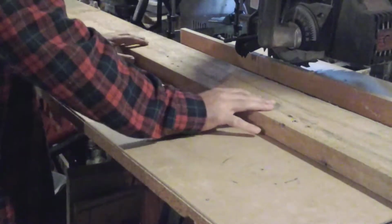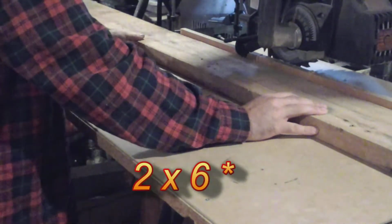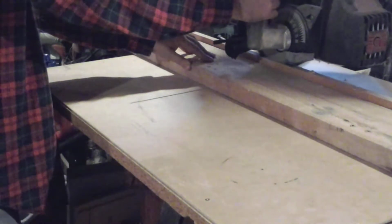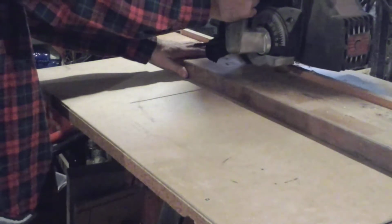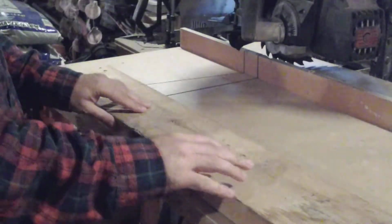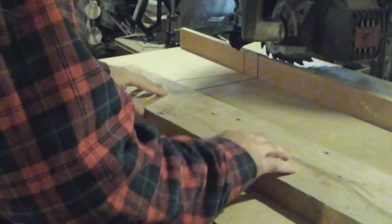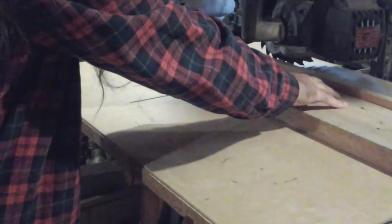Okay, we'll start on the radial arm saw, cross-cutting a couple 2x8s to 44 inches. Okay, without way too much fooling around, I finally got my saw indexed to 10 degrees. Most legs for tool stands and such are set at 15 degrees, but I want mine at 10 because I don't want it to have a huge footprint. So, let's cut our first angle at 10 degrees.